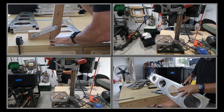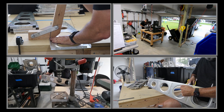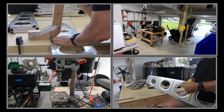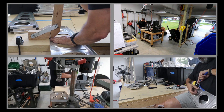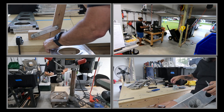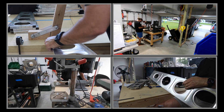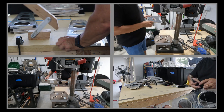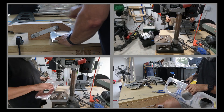In the bottom right you see me fluting. The trick of using a piece of string rather than a straight edge is super effective. The main ribs — much larger than the nose ribs — were actually quicker to flute. Even with more surface area, one light pass would get them really close. The nose ribs took a bit more time because the twist is often more severe around the curve. For nose ribs, start with the flat-ish side first — that can take a lot of twist out of the curved portion on top.